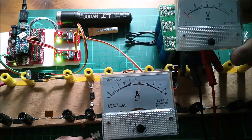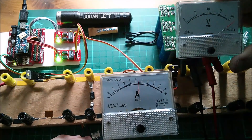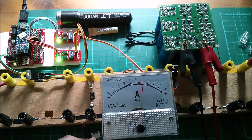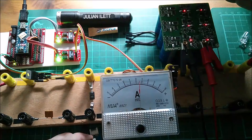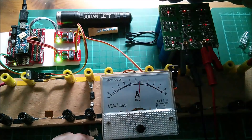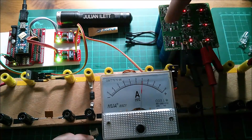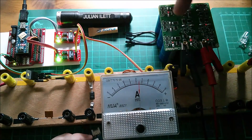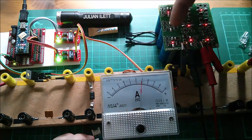Oh that's over 20 volts - yeah, so that's probably around 22 volts. We don't need to push much further to start getting protection circuits coming on. Let's raise that back up to an amp. Here they come - I've got four, five, six LEDs on. And of course the slightest tweak on the pot I can sort of control those. There was one cap that was well under all the others. I can light all those up if I give it about an amp. Those caps have come up to voltage so really I just want to put a trickle current in - about half an amp - and then just wait until this lazy cap gets up to voltage.